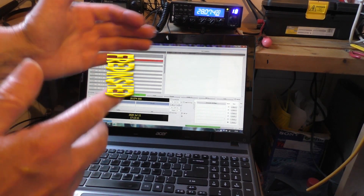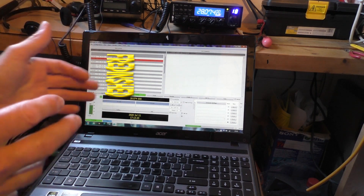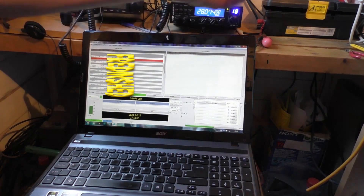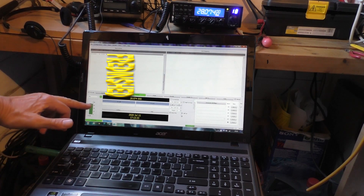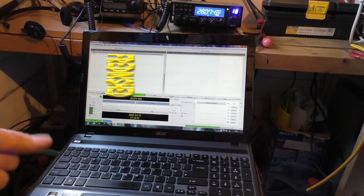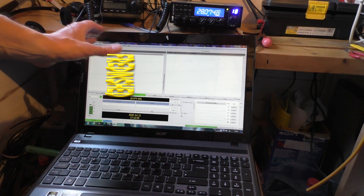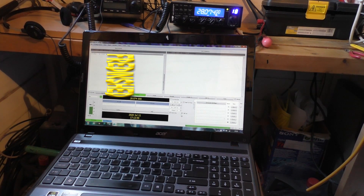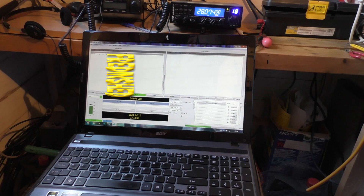Yeah, it's working! I've put in Region 1 in the settings, and that seems to have helped. It was all down to the clock sync — as my neighbour cuts his grass while I make a video — the clock sync needs to be within two seconds and then it works. The volume level at about 50 dB, and using the RF gain on the radio to reduce the volume gives you a much more sensitive adjustment. As people said, it's like text messaging — information coming through in 15-second packets.